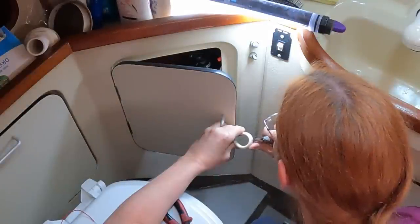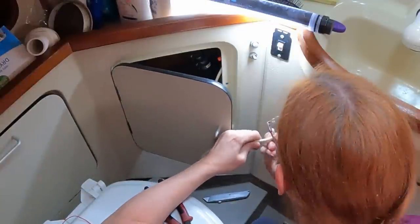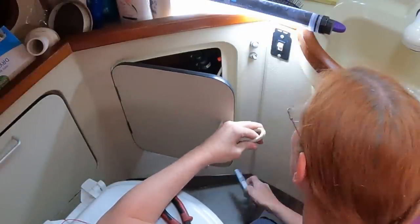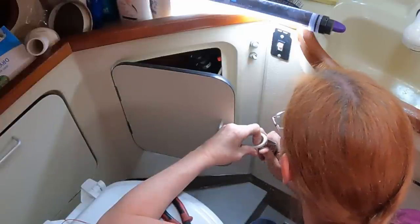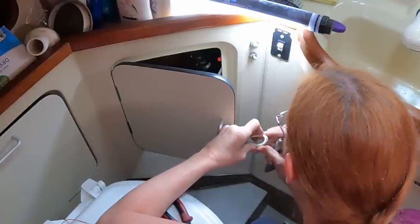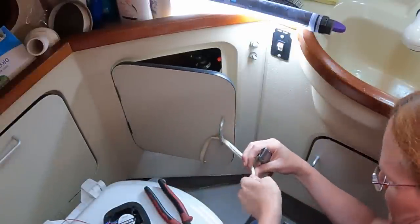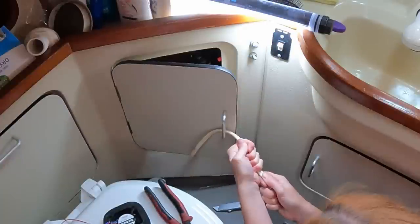This boat's going to be entirely rewired. I don't trust any of the wiring on this boat anymore. Like this kind of stuff here, I can actually see. This is tinned copper and it feels flexible. This is actually safe. There's not enough of it to be worth saving or reusing. So it's not like the entire boat is unsafe. It's just, well, 40 years old.